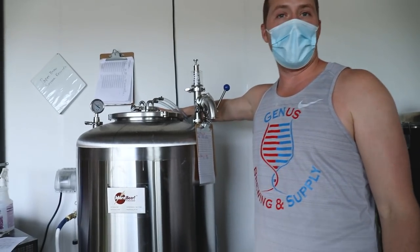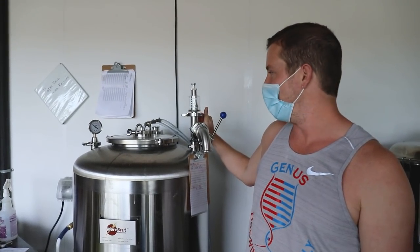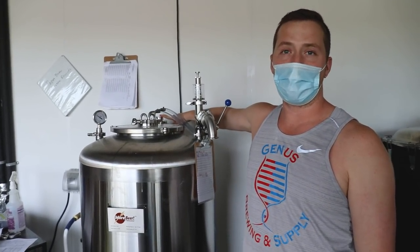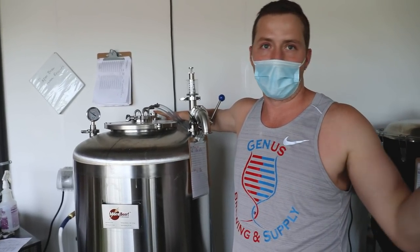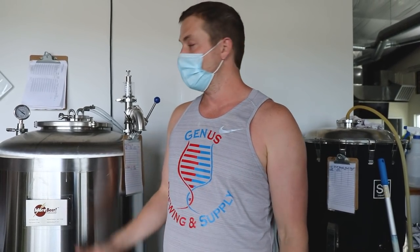On the backside, we replaced the PRV with a butterfly valve. We can use the spunding valve as a PRV as long as it's adjusted low enough. Having the back as a butterfly valve lets us open it up and make any additions during fermentation — whether that's enzyme for a brut IPA, nutrients for a high alcohol beer, or dry hopping. This is the review of this super sexy beast. The reason we got it is it's going to help us make fantastic IPAs while minimizing oxygen risk. It's pretty much going to be our IPA tank — unitanking means zero transfer, zero oxygen pickup. Completely closed system: ferment, crash, carbonate, and keg off of the same vessel.